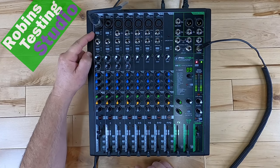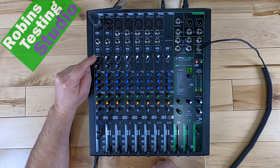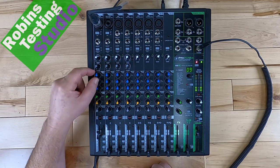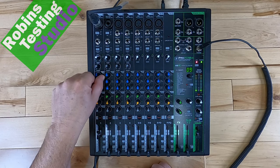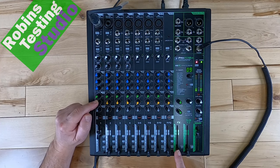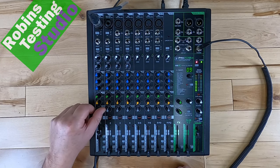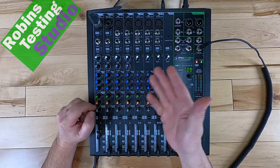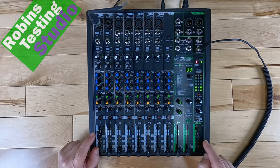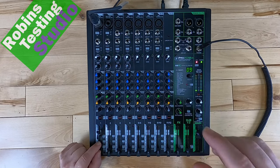So what's going on here? We have the high Z off because we don't have a guitar plugged in. We do have the low cut filter on, but that doesn't really help my showroom out too much. Our gains are set at about 60%. We're not using a compressor because I'm just talking and I'm within reasonable range for volume. We have our EQ set at unity — I could turn those down and up again; that's the high, this is the mids right here, plus or minus 15 dB, and again we can do the lows. Monitors we're not using. Our effects are right now off, but we do have them set to 50% so we can demonstrate that. And our pan — right now we're in unity; I can go to the left channel or to the right channel. Because this is a two-channel out, this does affect the sound in your ear. We don't have anything engaged here except for left-right to main, because I'm controlling the volume at unity here.